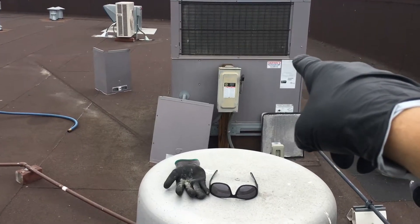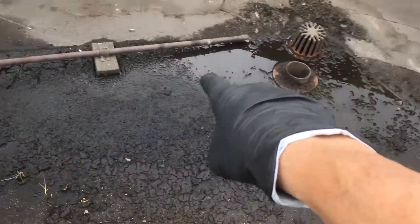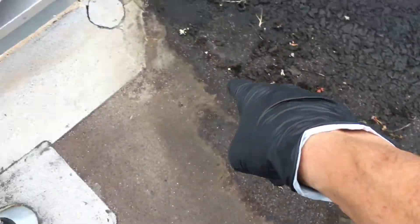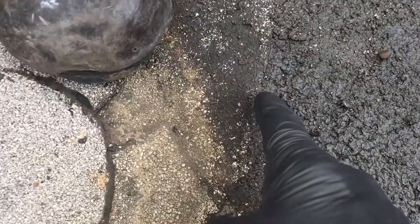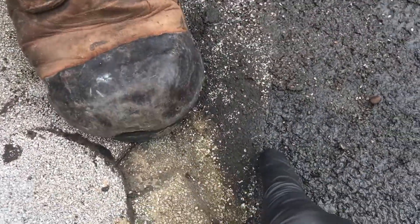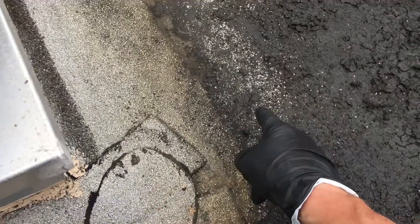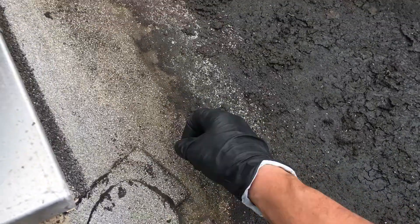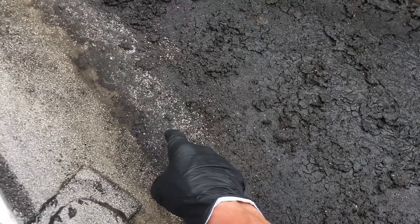The unit is over there, but the leak is happening over here. See where this big puddle is — see this little seam? See that little bubble bubbling out? As Tommy's stepping there, water is popping out right there. So this fills up and goes under where it's lapped off and sealed, leaking backwards underneath. I was knocking from underneath and Tommy found the area where the mildew is.